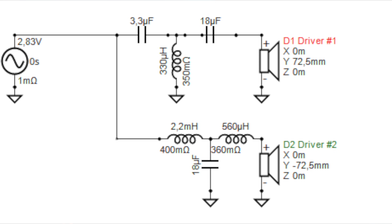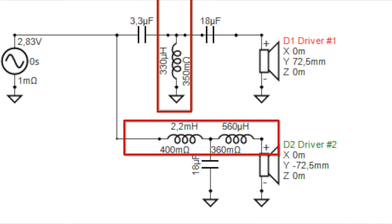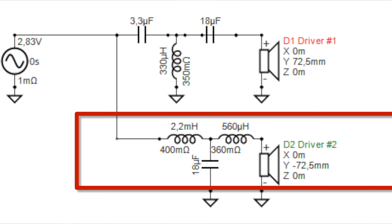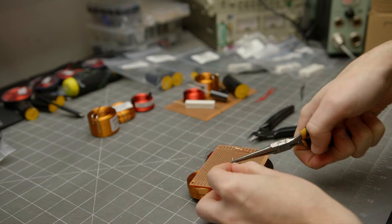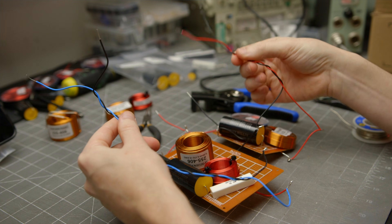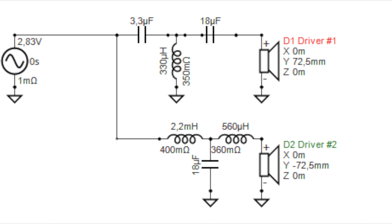You're going to need the following components. Something important to note is that you want to get inductors with as low a resistance as possible — ideally under 0.4 ohms. I'll have all these components linked in the description, but just in case any of them disappear off the internet, keep that spec in mind. As far as the schematic is concerned, this part is for the tweeter and this part is for the woofer. Once your crossover is assembled, put it into the chassis and connect it to the tweeter and woofer, as well as to your SpeakOn connector. As a quick note: if you want less treble, you can put in a resistor that goes straight to ground. A lower value resistor will lower the tweeter output volume; a higher value will do less. If you like the stock tuning, just leave it with no resistor.